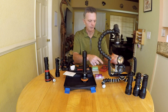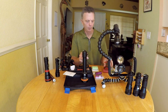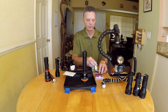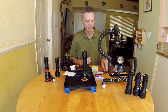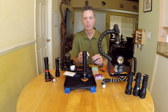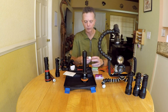I always like double-checking my battery charges. These are called 3.7-volt batteries, but at full charge they should be about 4.2 volts. I'll always monitor my voltage and make sure they're fully charged before a dive — checking that they're at 4.2 volts or close. It's good when the charger shuts off around 4.19 to 4.2 volts; if it's charging over that, that's not good. I've also done more research on storage: I used to store my batteries fully charged, but now I store them at 3.7 volts, which is about a 50% charge — a good storage voltage that helps extend battery life. I also put dates on my batteries when I receive them so I know how old they are.